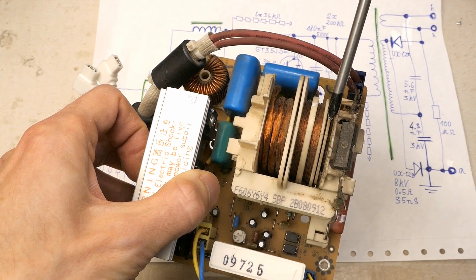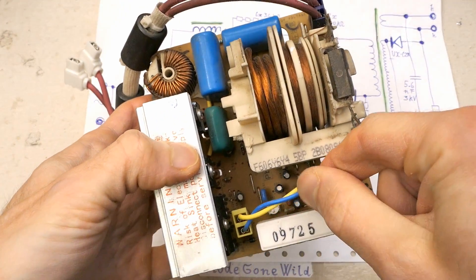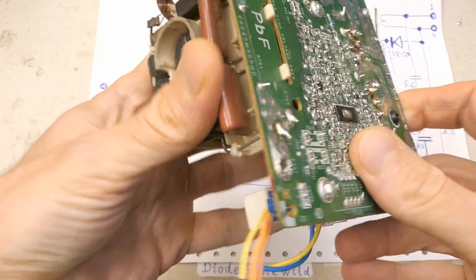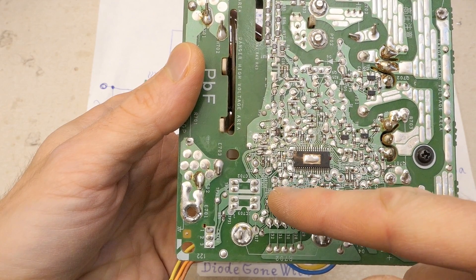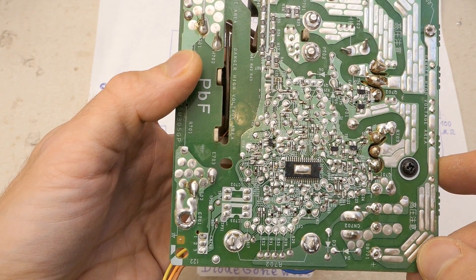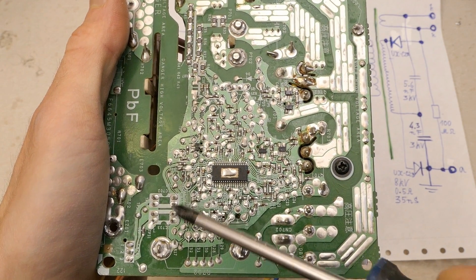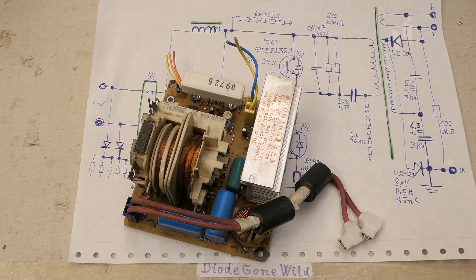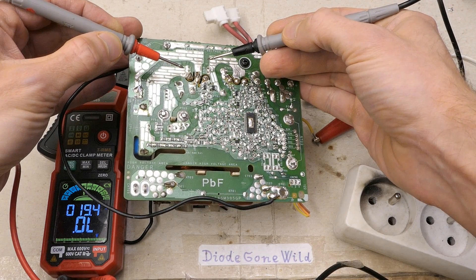This is the high-voltage secondary winding, and in this narrow slot is the heater winding — just a couple of turns. Everyone is asking to power it — should I try? The mains comes in here, and the only other cable has 3 wires going to a pair of optocouplers. One wire is common; via these optocouplers the control panel probably gives signals to turn on or regulate power — not sure if it's pulse-width modulated, linearly modulated, or some more complex digital communication.